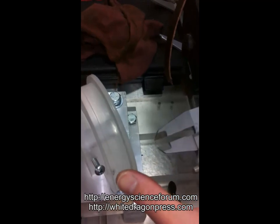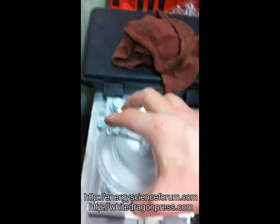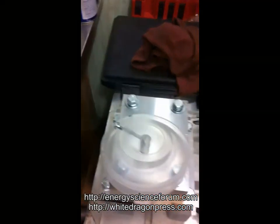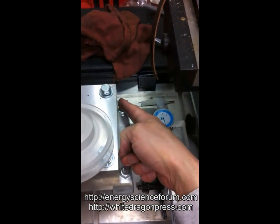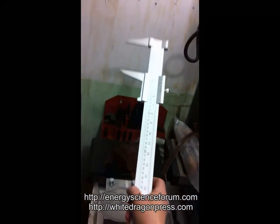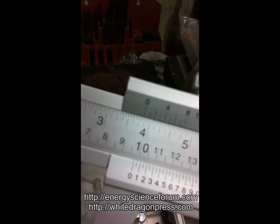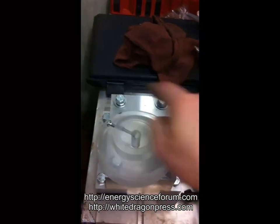These smaller calipers — unless you've got a deep jaw caliper — you're not going to be able to lock onto a wheel that big. To make it easy: 3.82 inches diameter will give you a 12-inch circumference, making it one foot in circumference. I was looking at deep jaw calipers and they're pretty expensive. So this is a $9 giant caliper from Harbor Freight — that's it — and it did the job because it can actually measure that. The measurements are only in 16ths of an inch on the standard scale, and here I'm just a hair over 3 and 13 sixteenths, which is about as accurate as I can get with this equipment to reach 3.82 inches for one foot circumference.